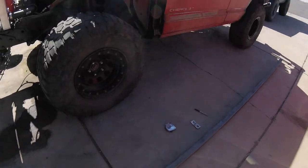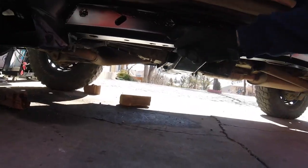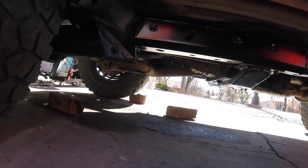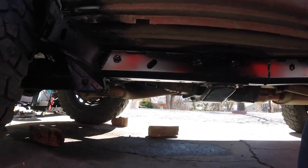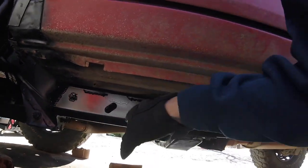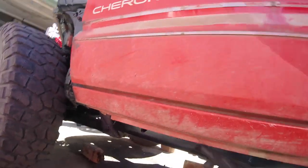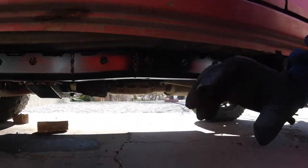I'm going to make some side rails. As we saw last episode, we got these guys welded in, a nice sturdy base to weld on some side rails. I'm going to hammer this seam flat so I have a nice angle clearance for the side kickers to come out. Light some round tube, probably three of them.